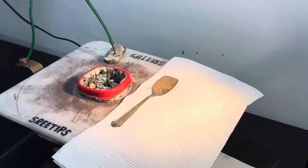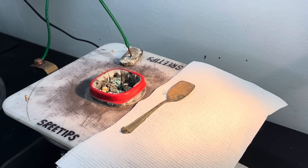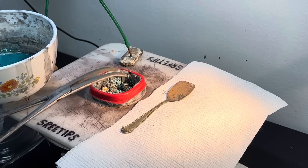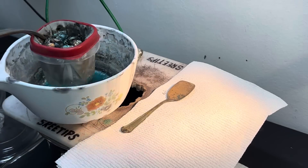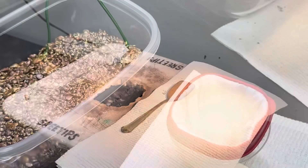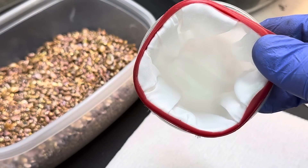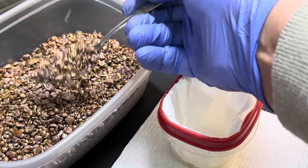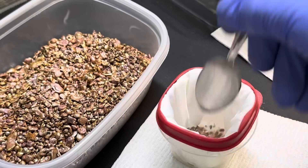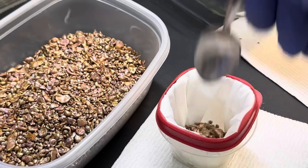What we're going to do is I'm going to remove this anode filter, pull it out and just put it in this container temporarily. I've got a brand new filter basket prepared with a new filter in it. We're going to try some of this real fine grain shot that we poured in a previous video here a few days ago.